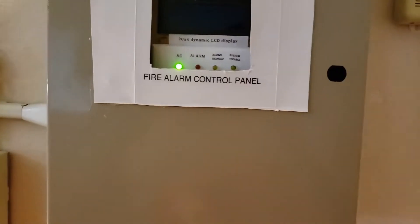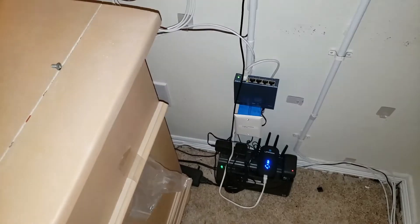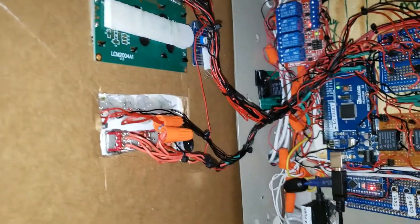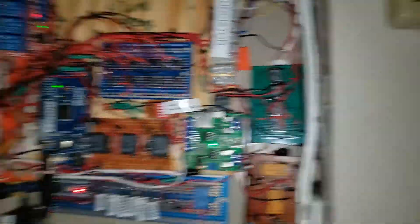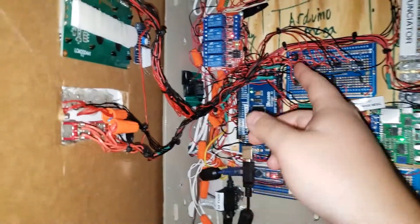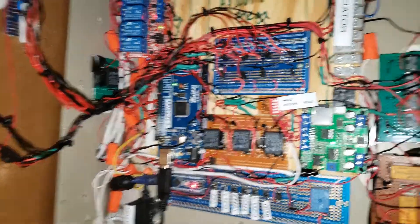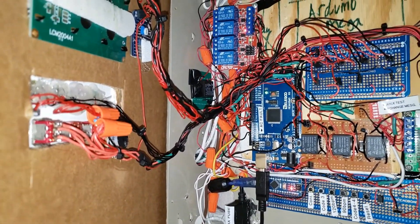As you can see, here is the panel right here. I'll open it up and take out these screws — it takes two minutes. Here it is. It's much nicer now, more organized with the display and controls. There are some wire nuts here, including two for the resistor to the LEDs to limit the current. I actually soldered the wire connections to joints and then heat-shrunk them, so it's pretty much nice and neat, not a rat's nest anymore.